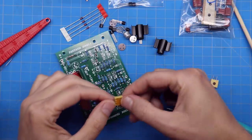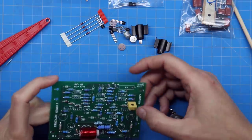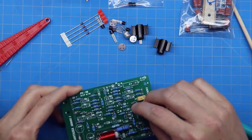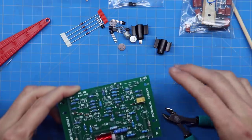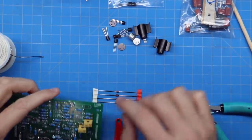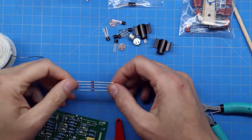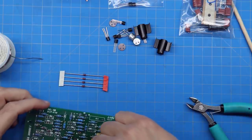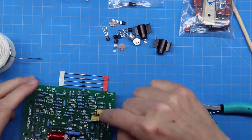Up next, the two potentiometers. It says take the turn dial — which is only on one side — and face it towards C1, and P2 faces a specific direction too. Then there are four zener diodes, 47-43As — same thing, a stripe on one end for the cathode. On the board these are denoted Z1 through Z4, rather than D1 through D5 like the regular diodes.